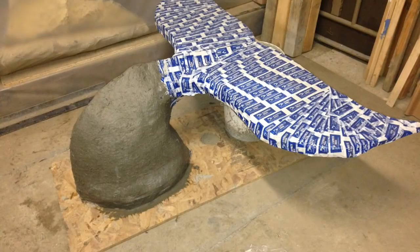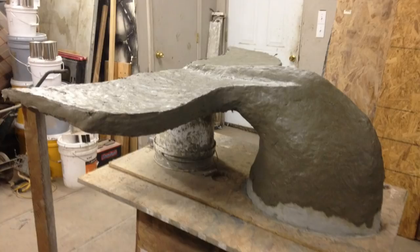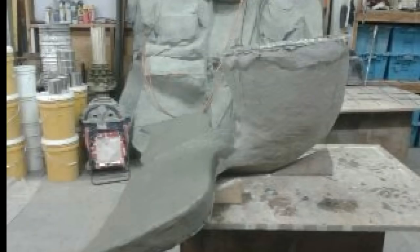In these next two shots, I started out by mudding the base and I let that sit overnight. The following day, I came by and mudded all areas with the exception of underneath the fin, which is held up by a bucket in this shot — you couldn't get the mud to stick up underneath there. The next day, I came by and mudded underneath it. In this photo, I had already taken the cardboard form out from the body and from the underside of the fin area, and then proceeded to mud the underside of the fin so that the complete bench had been mudded.